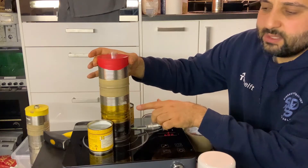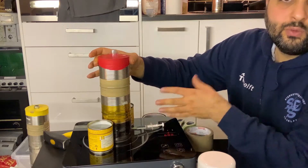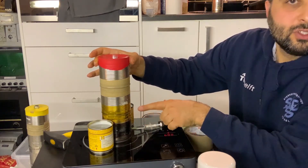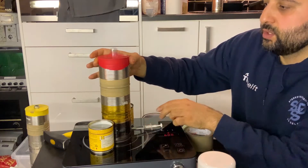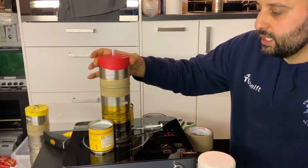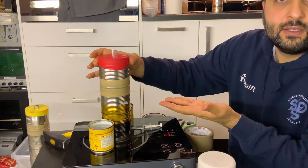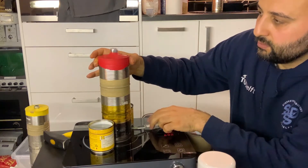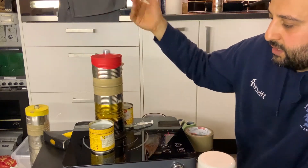You can see there is some smoke coming out of the engine because this gets very hot. You can also fill the lower part of the engine with water — in that case the engine will not get very hot and you can use normal tape there. This is basically the new version of the thermoacoustic engine. Later on I will solder this together and add some heat sink so we can see the performance a bit better. It runs away from the heat.